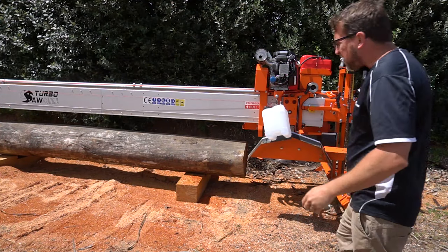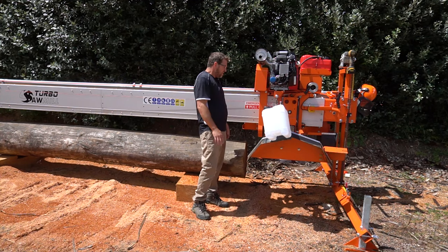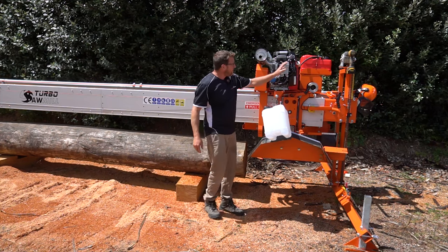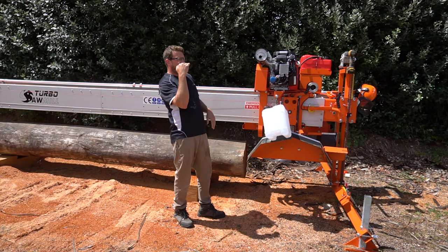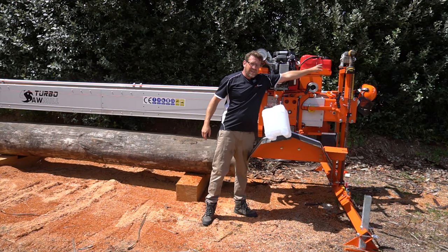So before we get started, traditionally you set your blade horizontally, perfectly flat, which means you have to dither around with the settings and so on. But I actually like to do it on the gearbox there. You can actually look at the difference between the two cuts, and if there's a big step like 4 millimeters, you can actually adjust it right there on your reverse cut.